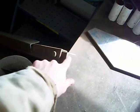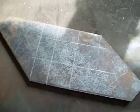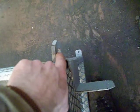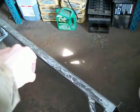The gate, I cut the pieces out of angle iron, and this is just like old-fashioned bed rails, and it's perfect for what I need. That's all cut to length, so that's good. I'll have to start working on the gate. I've also got a few things measured out there to cut. These are these here to put the rod through for the gate. I'm going to have probably 2 others in the center, so when there's weight on them, they won't bend.